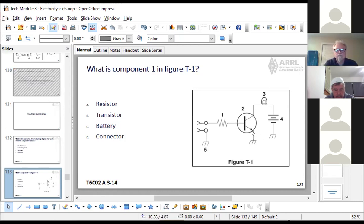Anyway, the current is flowing from here through the light bulb here. If you put a small voltage on this, you can vary the brightness of this lamp. You put a voltage with a potentiometer on it, and adjust it up or down. The light will go up and down. If you put a microphone here and start speaking into it, this will flicker according to the voice.